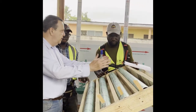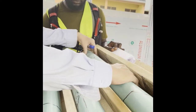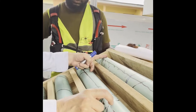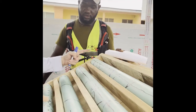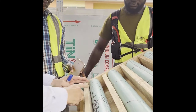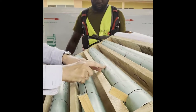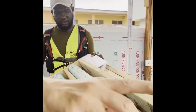Next, we need to define the sections for cutting, and for that we're going to use a blue marker. We have here a quartz vein — a very good quartz vein — so that will be its own sample. Here we have a very small quartz vein, so we are not taking that individually because it will not generate the necessary weight for the sample; it will be part of the interval. This first part is a lithological unit — the soil — so I will sample this. Then I measure one meter to get the second sample, another meter for the third sample, and whatever distance remains will be the next interval.